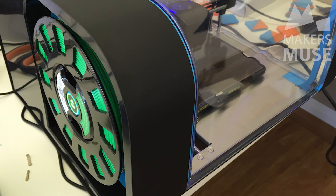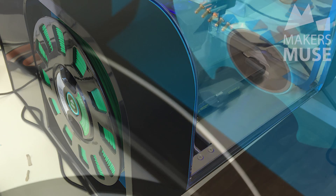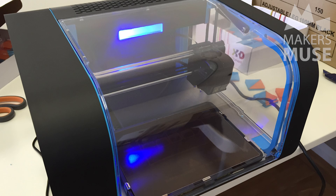The multi-purpose button on the side of the spool is a really nice aesthetic touch but it also lets you hot swap spools during a print — you hold down to withdraw, change the roll, and the sensor will automatically guide the filament back into the head to continue. I do think it needs some sort of display screen though; it's a bit unusual having a printer with no screen or buttons on it. But you can still do everything via the computer, so if it keeps the price point down, I'm okay with that.